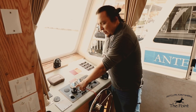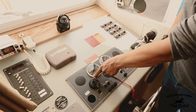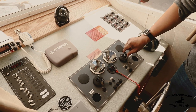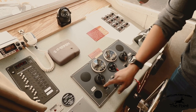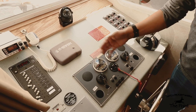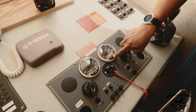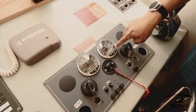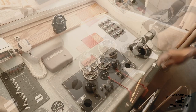Let's head downstairs to the main helm and run through the operating procedures. Starting with your key switches: they just need to be turned two clicks to the right into the on position. Once in the on position, turn and release on the key switches on the starboard side and on the port side. Keep an eye on the gauges and make sure the needle shoots up and idles at about 700 RPM. Note that I have the mode setting button pressed, labeled under the fuel gauge display — this is the only display you have for fuel capacity on board.